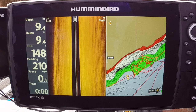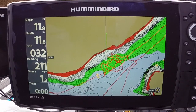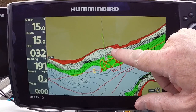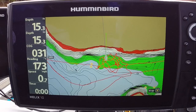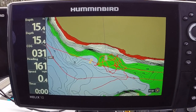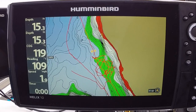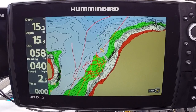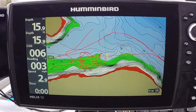So I think we have everything turned on — let's crank the boat up. On your chart menu you'll now see a purple line and a green line. The green line is the direction of boat travel and the purple line is the direction the heading sensor is pointed. Right now our boat and our GPS are moving basically in the same direction. Let's get a clear path. Pay attention to Course Over Ground and Heading — I'm turning in a circle. The green line is the GPS Course Over Ground line; the purple line comes from your heading sensor.